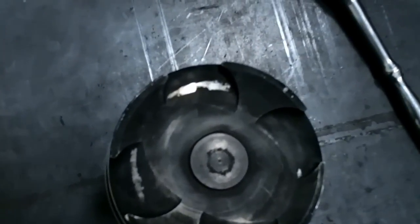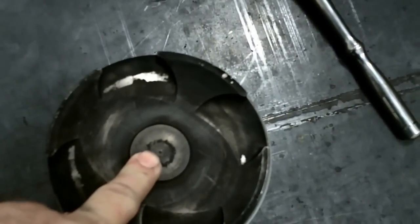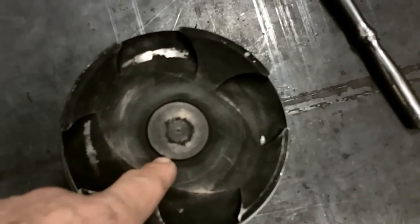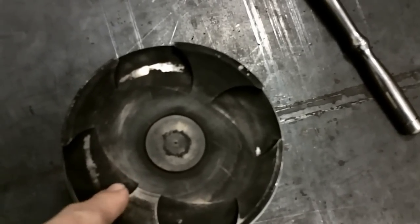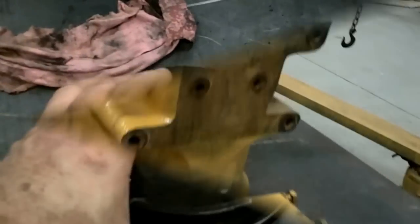This is the piston. If you notice, this is a steel plug that goes in the top. That pre-cup blows the fuel in on that — if you didn't have that steel plug in it, it'd burn a hole through the piston. Usually when you take these apart, if they've been over-fueled, you'll see cracks coming out from that plug, and I've seen them come as far out as the valve pockets. These pistons are really thick. There's a self-locking nut and a washer that holds that plug in.